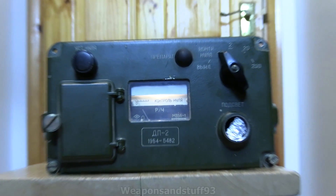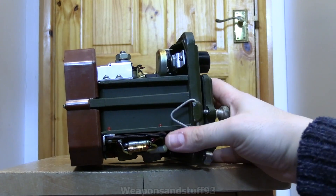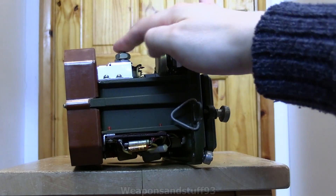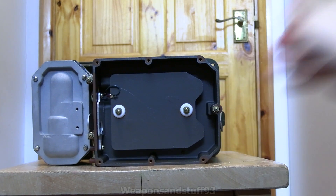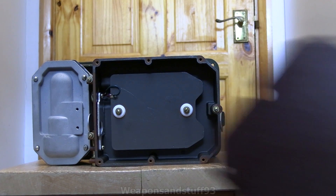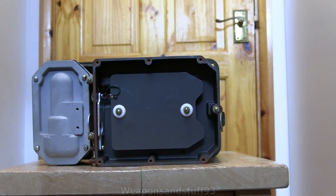So let's spin the unit around before I connect the battery so you can see what it looks like on the inside. There is your meter itself. This is your ionization chamber. There are your calibration controls on top. That is the ionization chamber with the bottom removed. The bottom of the ionization chamber is pretty boring — it's just a bit of bakelite that's been coated on one side to make it slightly more conductive. Because this is an open air ionization chamber, we can actually give it a reading using an alpha emitter very easily and safely with it open like that.